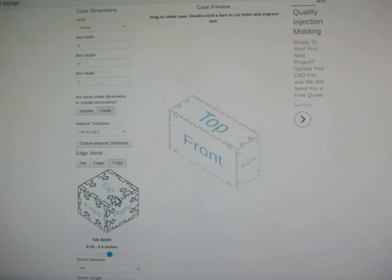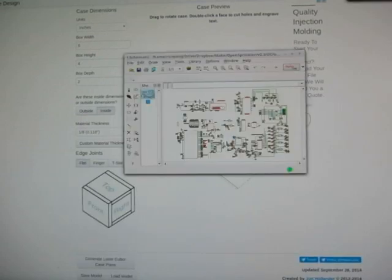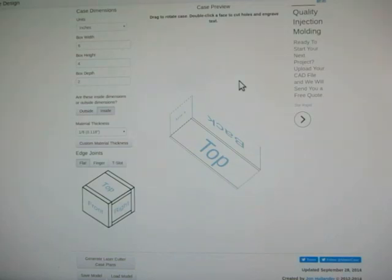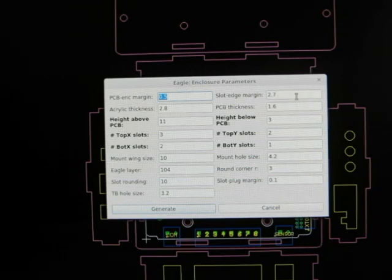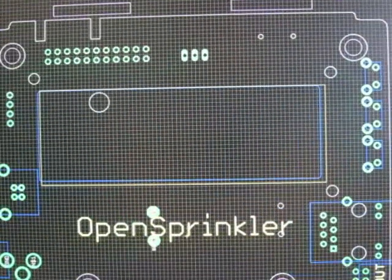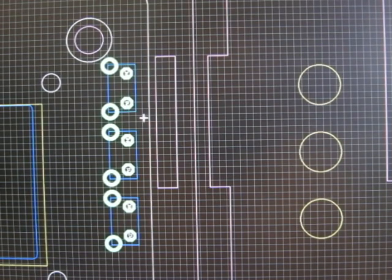When I started learning to make these enclosures, I did find some tutorials and design tools online, but they're not really convenient and easy to work with. Because these tools are not integrated with the Eagle CAD software, which I routinely use to design my circuits, I had to switch back and forth between different software and do a lot of hand calculations. To solve this problem, I wrote an Eagle CAD script which allows me to create enclosure designs that are embedded within the circuit board. This way I can easily align the enclosure outline with the circuit and make sure that all the custom cutouts are perfectly aligned with their designated buttons and connectors.